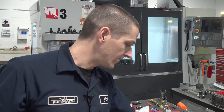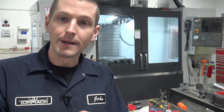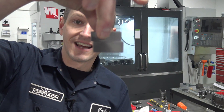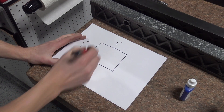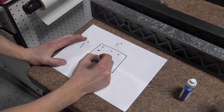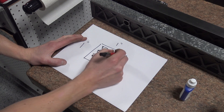One of the other problems with using a surface grinder is yes you get a beautiful finish and it's relatively flat, but just like these two gauge blocks when they're perfectly flat they'll do what's called ringing — they'll stick together. That's not good for two surfaces like a dovetail or a gib in a machine that are supposed to contact each other. So what you do with scraping is you scrape for what's called points per inch. In one inch by one inch, you want approximately 20 points per inch — that's showing nine — and those points should cover about 40 to 50 percent of the area.